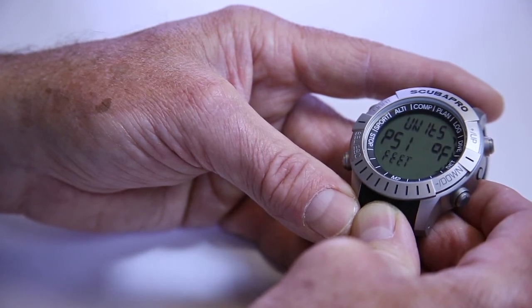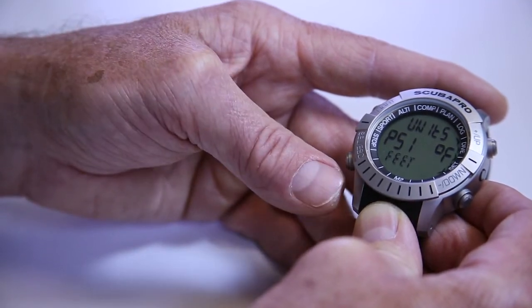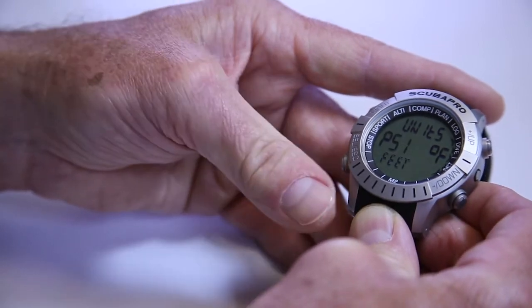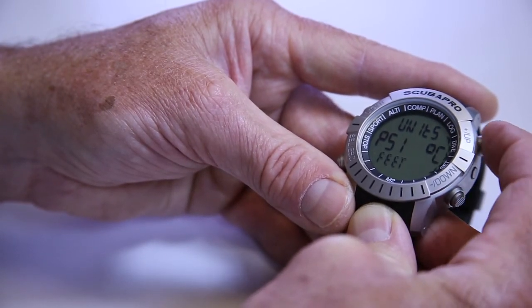The next mode is going to be our user mode. The user mode is where you can set the unit to be specific for you. This is where I would set my heart rate parameters — my heart rate high and heart rate low. In this case, I have a heart rate high of 170 and a heart rate low of 60. I can also have it set to default to either work of breathing with the transmitter or heart rate, defaulting to whichever one is highest. Next, I've got units — I can adjust it to psi or bar, Fahrenheit or Celsius, feet and meters, or any combination of the above. Whatever personalization you want as far as imperial or metric.